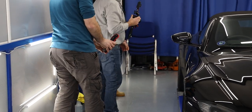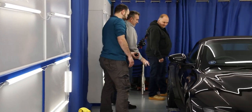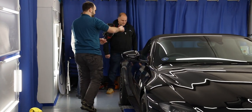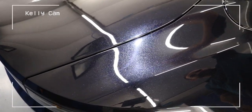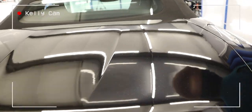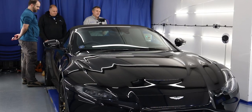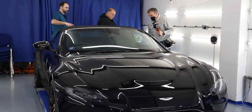As we go down the car, we've got the same sort of buffer trails — ignore the handmarks. Matt, put the light over there — yes — you can see this is all got buffer trails. Coming around, there's some marring and hazing. When I turn the strip lamps off and use just the spotlight, then zoom in, the clarity and flatness of the paint is actually a lot better than the Honda — because it's been sanded and polished at the factory.